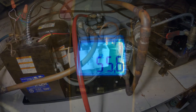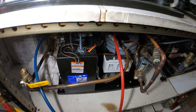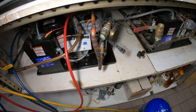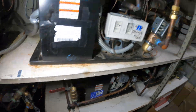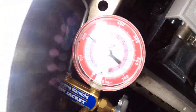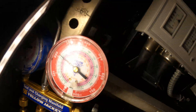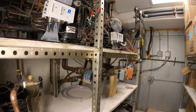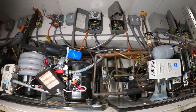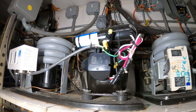Let's go upstairs and see the temperature. Got my thermometer in there — using the thermometer feature on my Fluke meter. It's on its way down. Pretty much just going to finish off by making sure we reach the right temperature and have the proper adjustments on our control. Everything's looking good. The main thing was that head pressure — now it's staying where I want it, about 215. If anyone found this video interesting or helpful, please drop a like, comment, and subscribe as I come out with new videos every week.